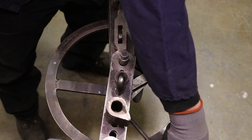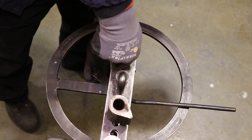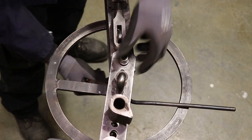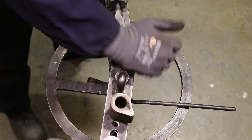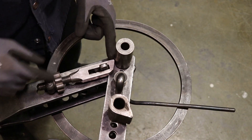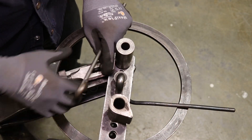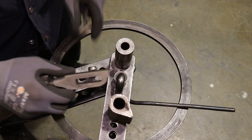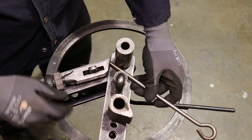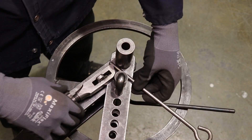The other side of the center pin will accept the smaller — I believe it's a five-eighths-inch pin — for that five-eighths-inch ID. So we'll flip around this center pin and adjust it at this little piece of sheet metal so the pin will sit at a lower position. It may take a little fussing initially, but with a little wiggling you'll be able to get it to sit a bit lower — now you can see we're a good bit further down and much closer to the surface of the bender. We can drop this die on and bend around it, but we can see our pusher is now a little too close, so we'll bring the pins back to make room.